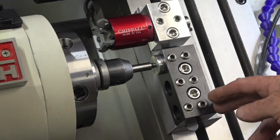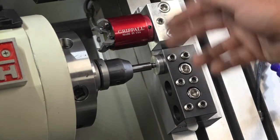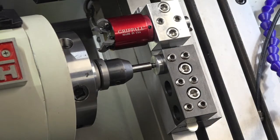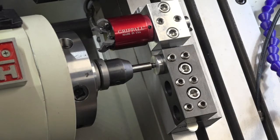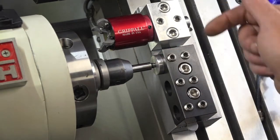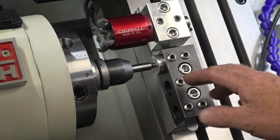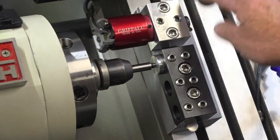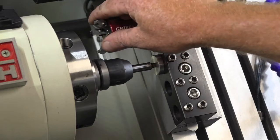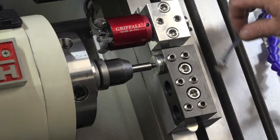So if the program calls for tool twelve, I would just take whatever drill bit is in there out, stick a new one in — or a boring bar or whatever it is — lock it in there, and then I'll just reset the new Z if it was something like a boring bar where it would slide. But if it's a holder like this, I still generally will come down and zero it out before I start, just to make sure. So what we'll do now is get this bolted in, get this set up, and then I'll show you how I find dead center on this.